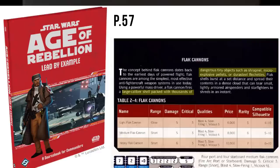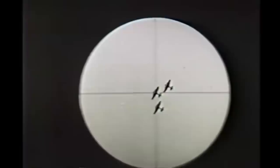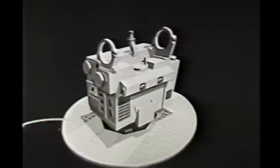What's really interesting is how advanced the target acquisition tech of World War II flak guns was. This is an actual Air Force training motion picture — highly recommended, link down below. The aircraft is picked up in an optical sight and held on the crosshair, tracking continuously and obtaining its direction and angular height while a stereoscopic rangefinder determines the altitude. At night or in bad weather, the aircraft may be tracked solely by radar. Whether tracked by optical sight or radar, the information is fed by electric cable to a director — a mechanical computer that digests the data and automatically computes the right lead, setting the guns.